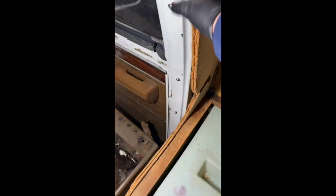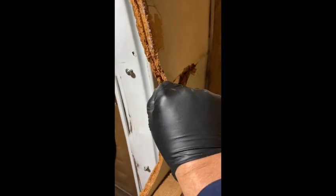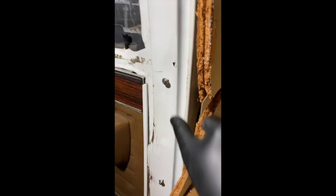And we took all the edge banding out of this, all the way around here. This piece of wood is super done, so hopefully I'll be able to splice in some plywood in there and make this look good as new. I'm assuming I'll have troubles in these areas because I think they're fiberglass on the back side there. Looks like this is two pieces here. Looks like they kind of have this biscuit piece in here to help it stay together. So when I get another piece of wood in there, I'll remember to use this technique.